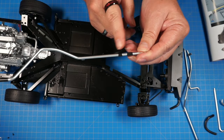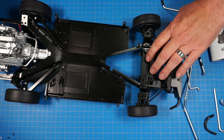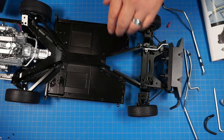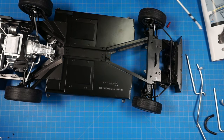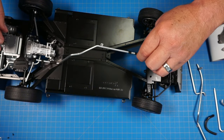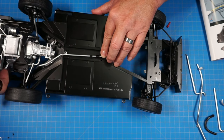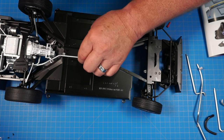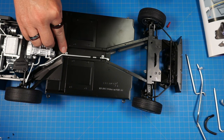That's going to look just like that. Now we need 30b — it's got two pieces on one end and one widened on the other side. We need to flip the chassis over. I want to protect the motor, so I'll put something under it — I'll use the screwdriver case like this so it's not sitting on the motor. This piece is going to run down inside here, underneath this arm, and sit on top of the frame on that side. It'll run underneath the dipstick. These two ends are going to sit on top of two pins, and we'll screw that in with two FP screws.